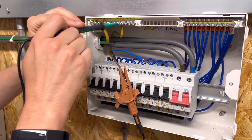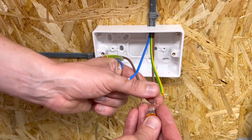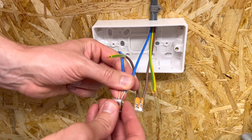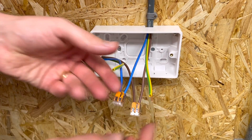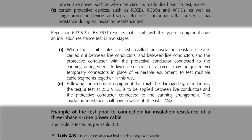When doing this test, it's critical that the CPC under test is connected to the installation earthing arrangement. It's also really important that the wiring system is completely connected throughout, with temporary connections wherever you've removed a socket. At this point, we prove that the insulation on the conductors is doing its job, especially for line and neutral. We need to test the cabling at 500 volts DC to make sure the insulation on the conductors is doing its job, and the conductors must be connected together where we've left the USB charging sockets off.